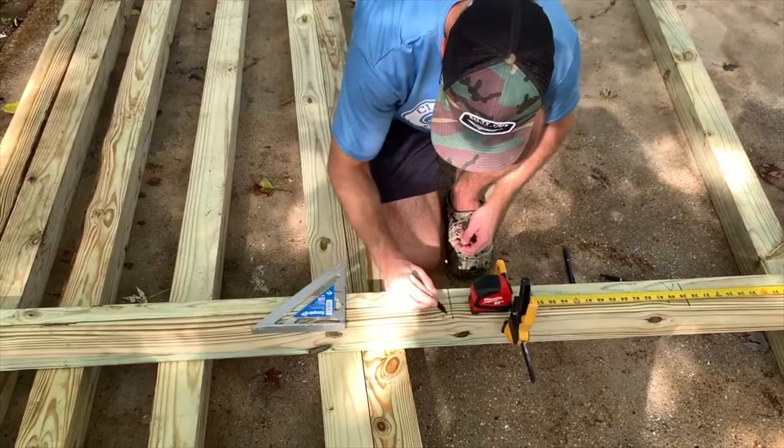After applying painter's tape to the perimeter of the shed walls, the next step is to apply our first coating of epoxy. In this case, it's the flexible epoxy primer, which is the Flex System by Spartan Epoxies. So to apply this, we're gonna mix it up and then we're gonna apply it to the subfloor using an 8 to 12 WFT mil notched squeegee, and then we'll apply it with a 3/16 inch nap roller.